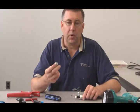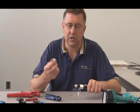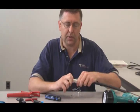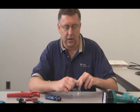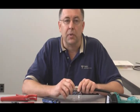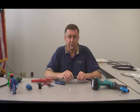You take your interface at this point. The pin is a gold-plated beryllium copper spring finger pin, just like many of our EZ style connectors. Just snap that onto the center conductor. Bring that back nut up, and you torque the 2 sections together. There are flats on the front of the connector and flats on the back. You torque that until that O-ring basically disappears, until you see metal to metal contact, and you're done. You've got the O-ring in the back there, and you're all set. Thanks a lot.